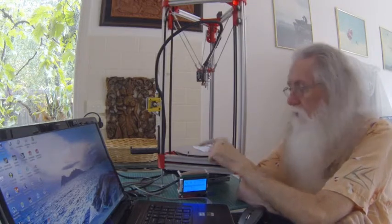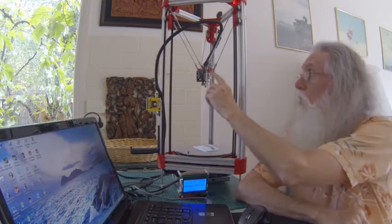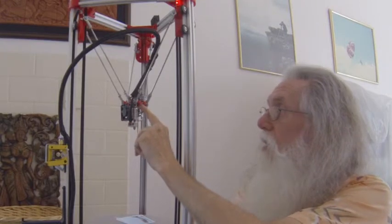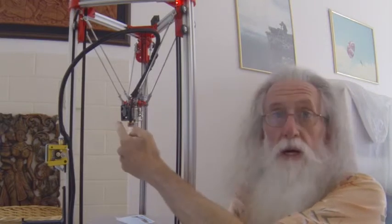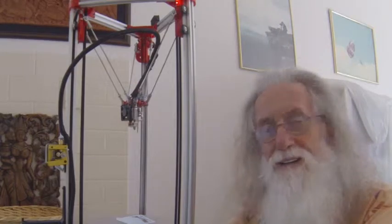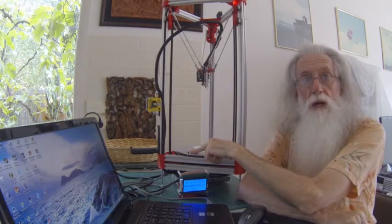When you set your table, set that socket head cap screw 80mm along there, which is fine, they'll fit fine. However, not mentioned in the manual, the Centron manual, when you set up your effector, have your probe pointing through the center line on your Z column. So this is one rotation out, and like I mentioned to you, I like to be able to clip it down and all that sort of stuff. However, if you do that, it means the probe is in a direction where it cannot reach the Allen key.